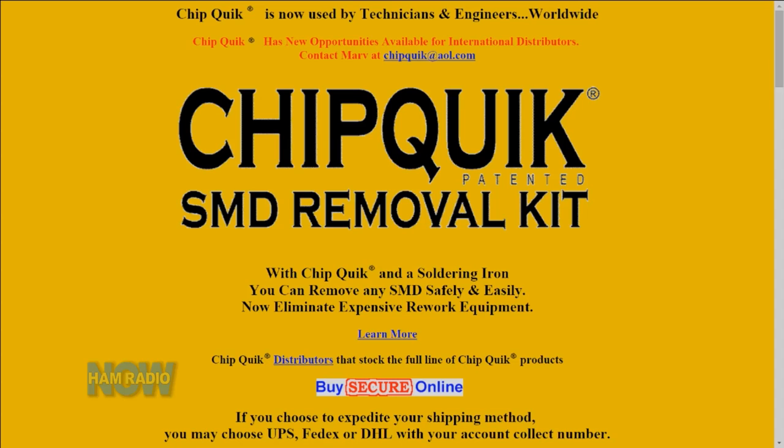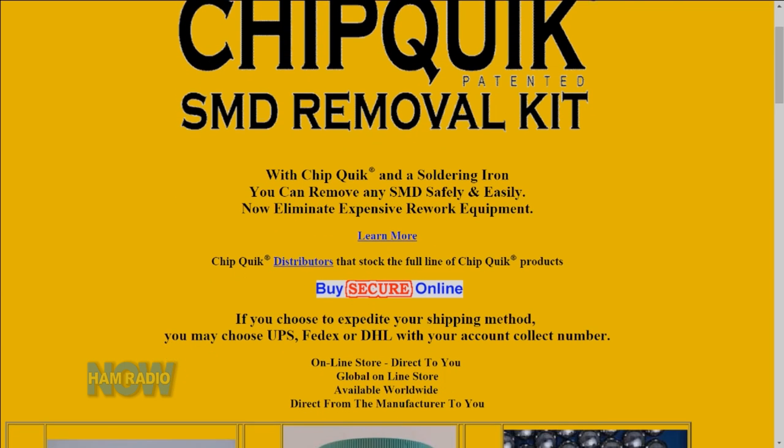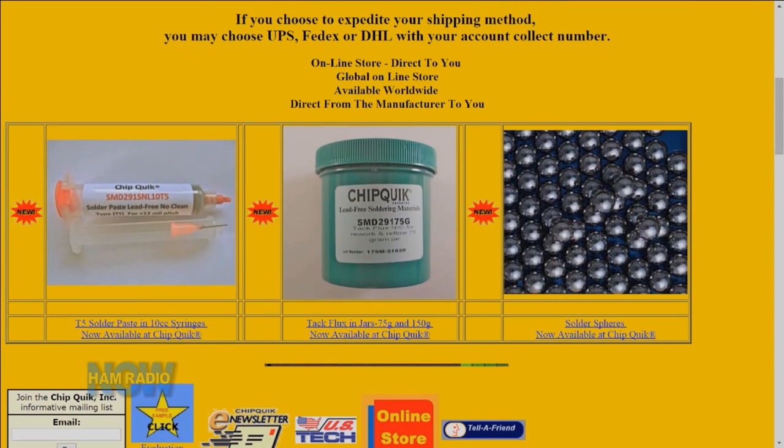What does bismuth look like? It looks just like solder — comes in a six-inch length, a little bit smaller than a 16th-inch diameter, probably 50 thousandths diameter. It's kind of expensive. I get it from a company called ChipQuick — that's C-H-I-P-Q-U-I-C-K. That's where the flux is from too, the same people. I was looking through the pictures I took with my phone and I don't see a picture of you doing that — so it looks like you add it as if you are soldering something, with the soldering iron? Yeah — you heat up the joint, add this stuff, and then suddenly things melt like crazy.